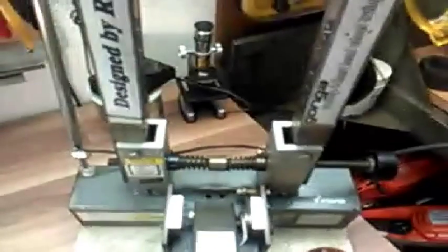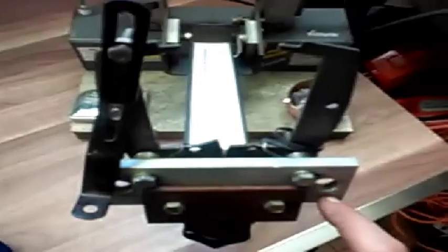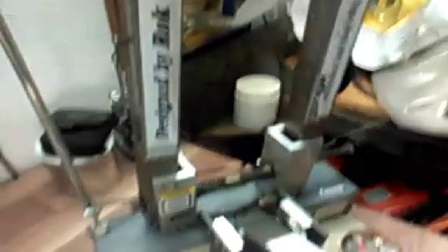I had to adjust the lower arm about three to four millimeters to the right side. But you can easily reposition this by simply untightening the nuts here and moving the lower arm left or right until it satisfies the center of both arms. You can also see I used springs which are actually just from standard brake calipers, some aluminum sheet metal — and that's how it looks for only ten dollars.